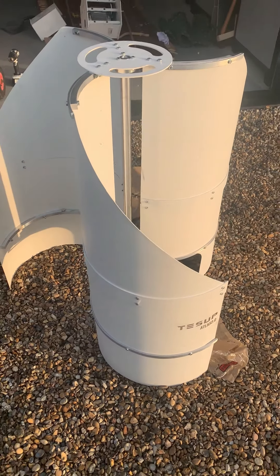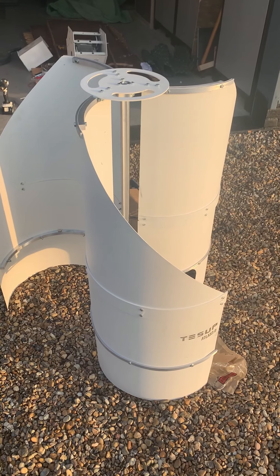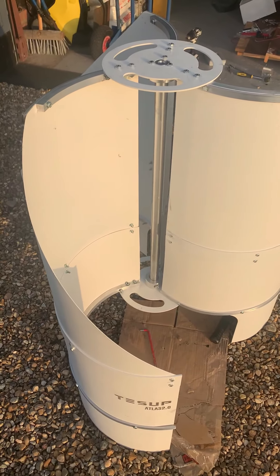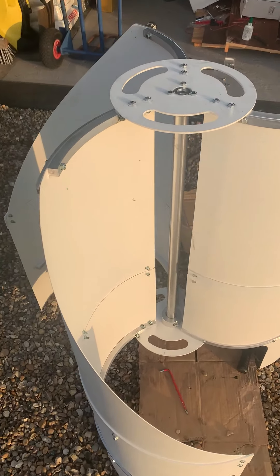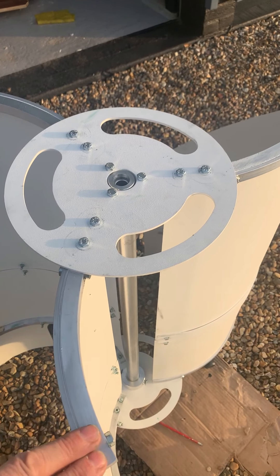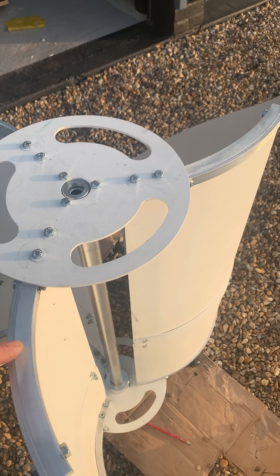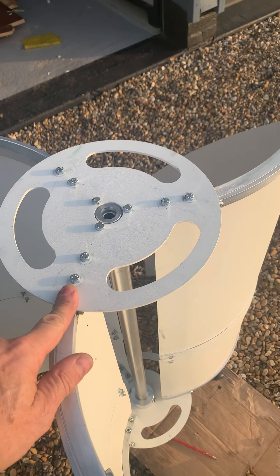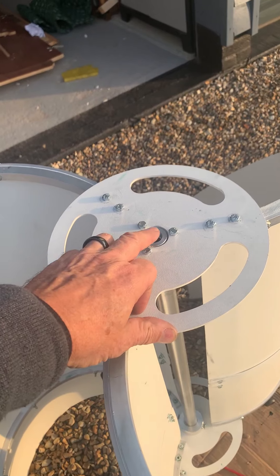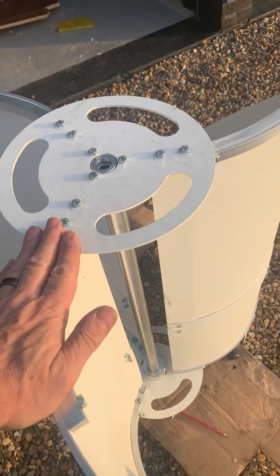Let's have a look at the finished turbine and I'll give you a few hints and tips about putting this together. If you saw the earlier video where I did the individual blades — one thing worth mentioning: I had to readjust this. Before you put it together, make sure that these two pieces are absolutely flush with the top of the blade. Otherwise they won't go flat against the plate for the spindle bush, and you'll need to take it off and do it again.